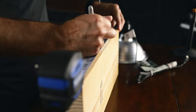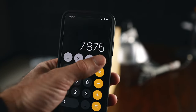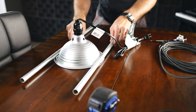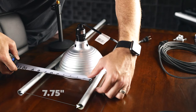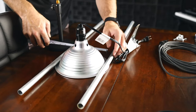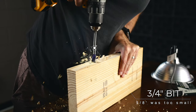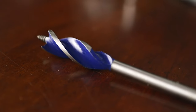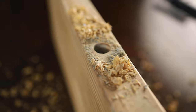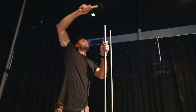I got my halfway mark, which was eight inches because the overall width was about 16 inches. Then I measured out by laying two pieces of the conduit on the table and measured out exactly how wide the conduit needed to be to fit the fixture properly. Then I'm going to install the conduit, using a three-quarters-inch bit to drill straight down into the top of the two-by-six board. Install your conduit and make sure the tops are perfectly level. One side of mine wasn't quite level, so I just beat it down into the wood a little bit more until both were perfectly level.